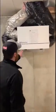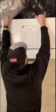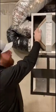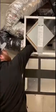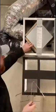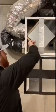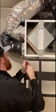The unit itself is right over here. We've got a sticker with directions on how often to clean the filters. These filters you want to pull out and vacuum at least every three months. All you've got to do is pop these little hangers out and then the filter will slide out. Vacuum it, pop it right back in, put the hangers back in, and you're good to go.